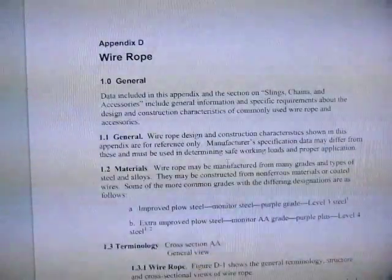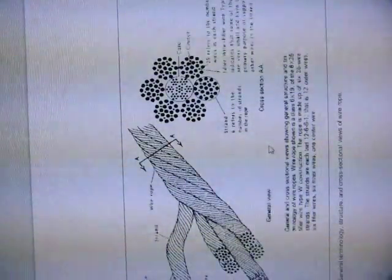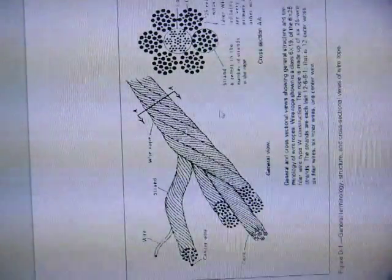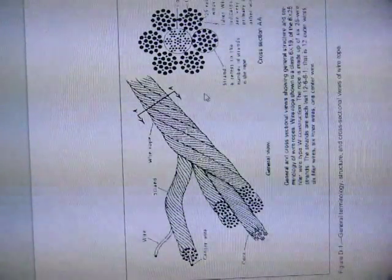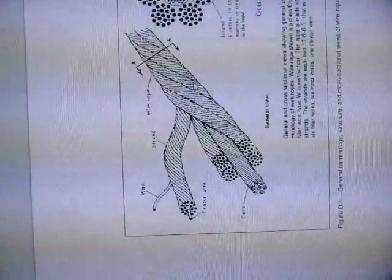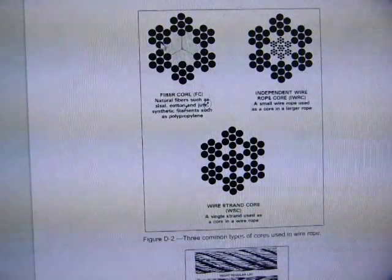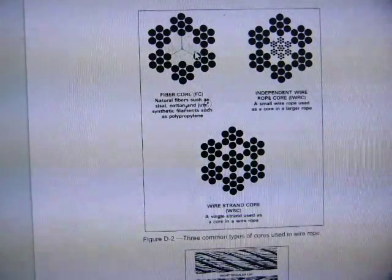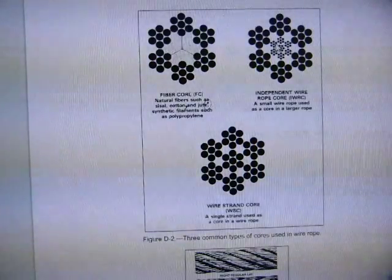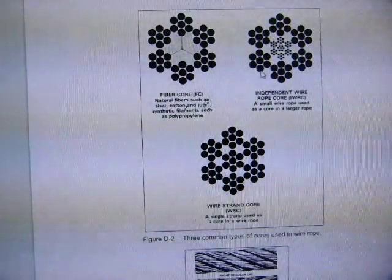Let's go back to the government document — that covers materials for wire rope. Looking at the terminology: when you unravel wire rope, it has strands, and within strands you can have different sizes of wires — big ones and small ones. Sometimes the inside of the wire rope has a fiber core (FC) that isn't carrying any load. Sometimes there's a wire core inside, made of smaller or same-size wires. You need to count the surface area of each wire — surface area is radius squared times pi for circles.